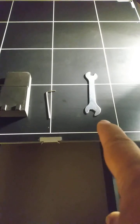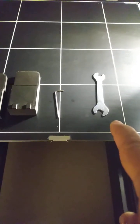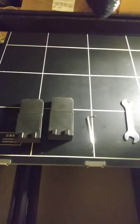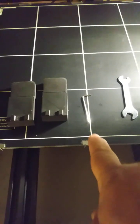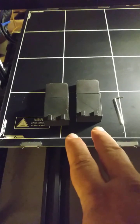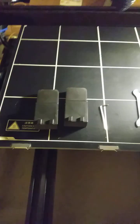Here are the tools you'll need: the flat wrench that came with your toolkit — if you don't have one, just something thin will do — so you can set the distance between the top of the gears and the stabilizer. You'll also need a two-millimeter Allen wrench and two leveling blocks of some kind, as long as they're both solid and won't smash or crush. These ones I got off Thingiverse — print them yourself or just use a couple of regular blocks.